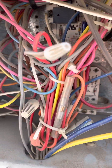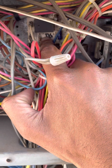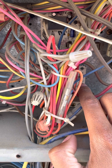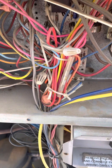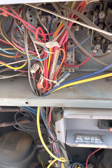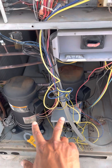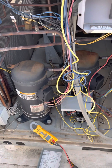This unit actually has two of them — this board right here, this black relay, and this board here at the bottom. Those are called your compressor lockout boards. As the name suggests, they're there to lock out the compressors or protect the compressors from short cycling in the event of a high-pressure trip or low-pressure trip, which puts a lot of stress and strain on the compressors.